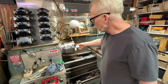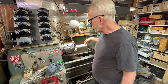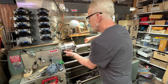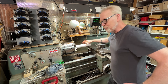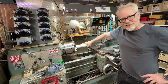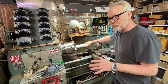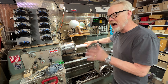Mine's got a nice big two-inch bore, so I can take a big piece — this is Teflon — and pop it in there, clamp it down. But what if I've got a lot hanging out? Even in the most extreme cases, like extreme pieces of steel, there would be deflection if you started to use a tool on it. It can deflect. In general, you want to do all of your lathe work as close to the chuck as possible — it's the highest rigidity.